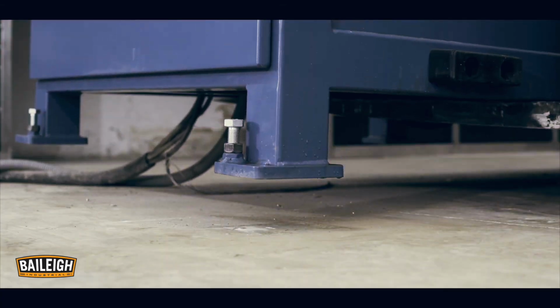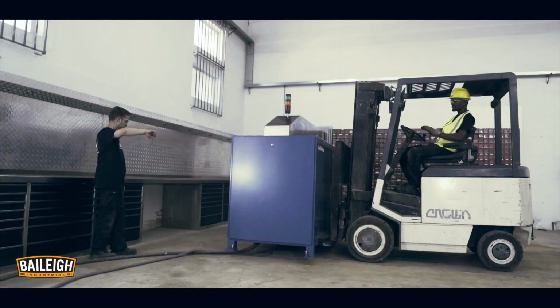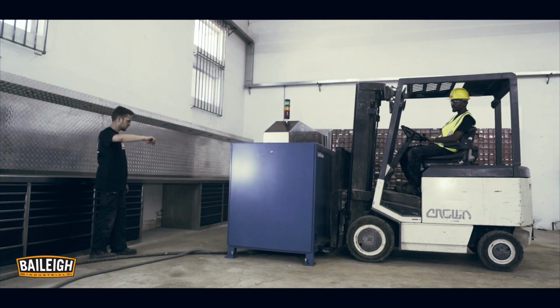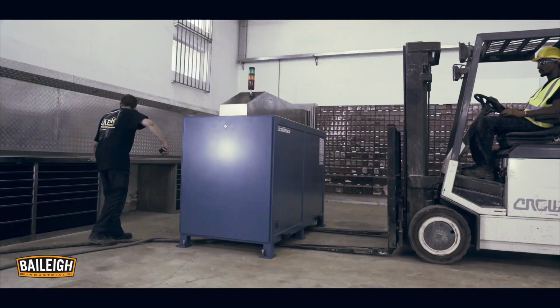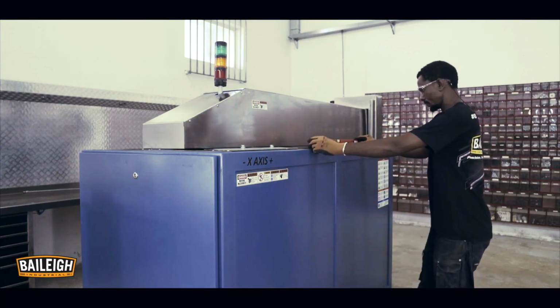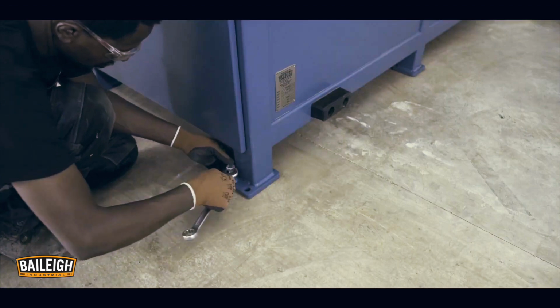Unpack the machine, tank, and console from the protective wrapping. A suitable location must be prepared with even ground. This should be placed such that a 9-meter perimeter is available all around the machine. Level the machine and make sure all feet are in suitable contact with the ground.